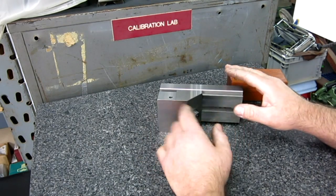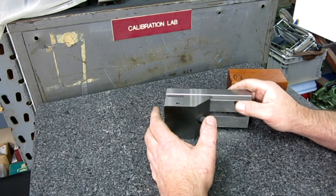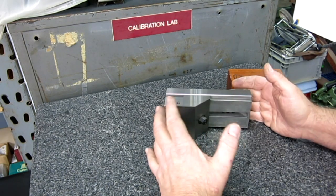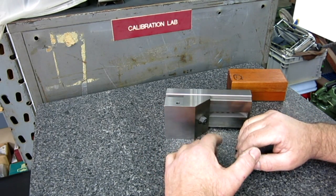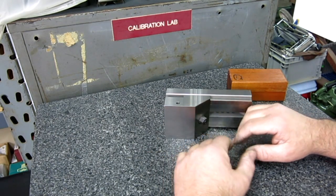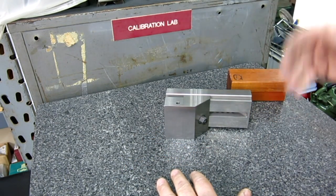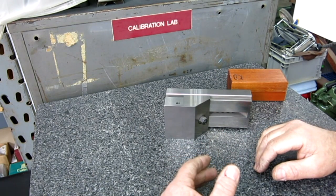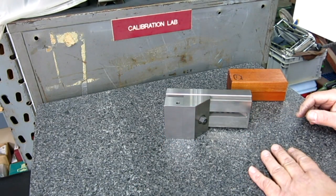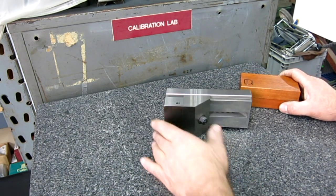So know this, that when you're working on the grinder and you're doing precision grinding work, everything's fussy, okay? You can't just throw stuff in a vise, tighten it up, and go to town, right? You got to check it, you got to look at it, you got to make sure it's sitting properly. It's a pain in the neck, right? Everything matters, all right? And the closer that you want things, the more it matters, right? Specks of dust, dirty surface plates, dirty gauge bottoms. I mean, everything matters, right? And if you can't repeat what you're doing, then you don't have control of the process, okay? That's your first indicator, right? Is I can't make two the same. Okay, so anyway, that was the screwy ball question.